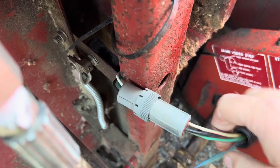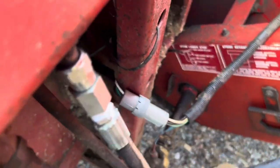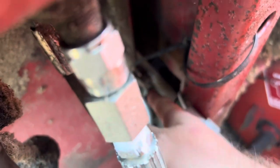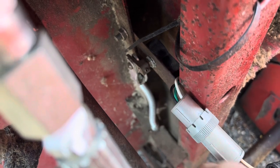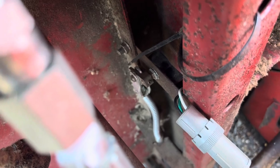The harness is short but long enough — it works. I'm not 100% sure I have it pinned out right; I tried it and it seems to work. I think the only thing I may have to do is adjust the pot, because if you read online you can find what the correct voltage should be for all the way down and all the way up across that range.